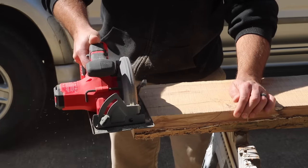Now, the mold that you saw me putting on this slab — I went back and taped the insides of these boards so they wouldn't stick after the epoxy hardened. Be sure you do something like that on the inside of your molds so the epoxy doesn't stick. Now I've got that mixed and I'm ready to pour.